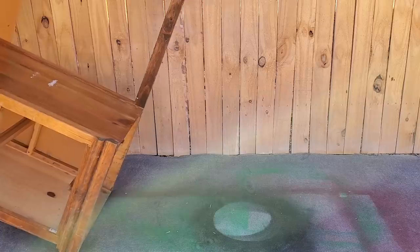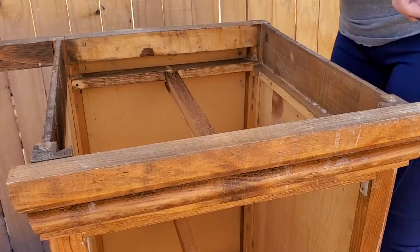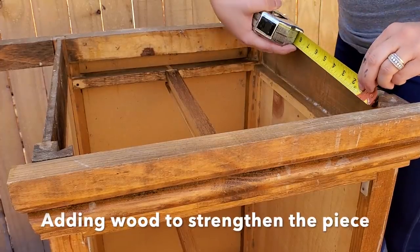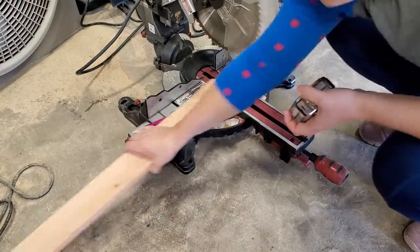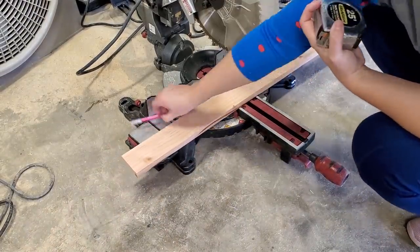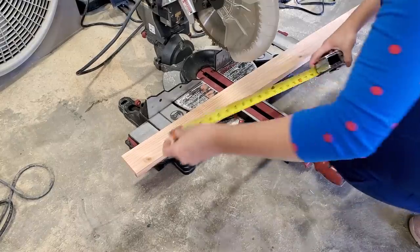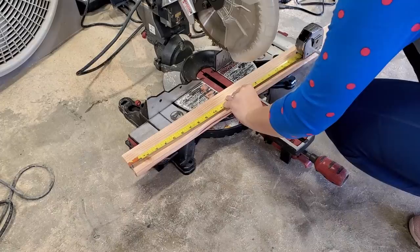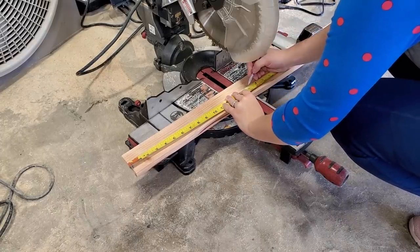Pine is not the strongest material, but it did have some very thick varnish over the tops which saved it. I think it could have been much worse without that varnish. So I'm going to add some wood scrap pieces that I had in my garage to the bottom to help strengthen the sides, because those sides were cracking just from the expanding and contracting of being wet and then dried out.